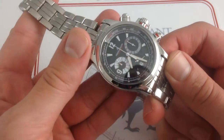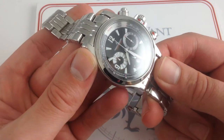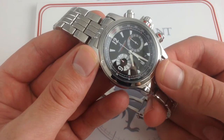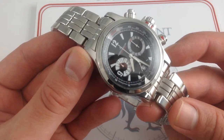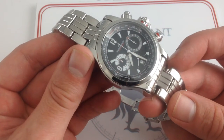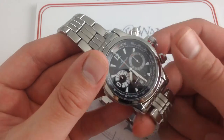The movement is part of JLC's caliber 750 family of modern chronographs — the first ever JLC in-house automatic chronograph caliber. It debuted in the early 2000s and brought all of the innovations of modern JLC watchmaking, materials science, and mechanical engineering into a single easy-to-use and rugged package. It is a column wheel chronograph.